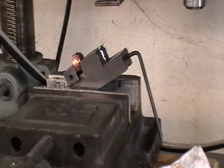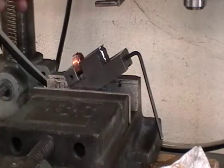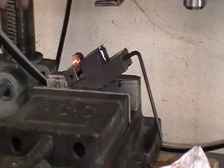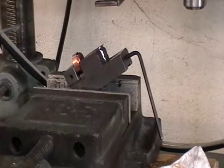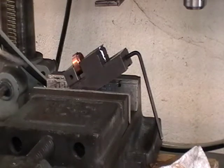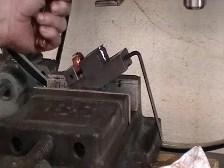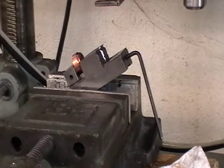Being it is so small in diameter, what we found works pretty well is we used a plunge-cutting end mill, or center-cutting end mill, that's 28 thousandths — I think it's a number 70 drill. The shank is a little bit bigger, so this way it makes a rigid support. And we were pretty successful with this.